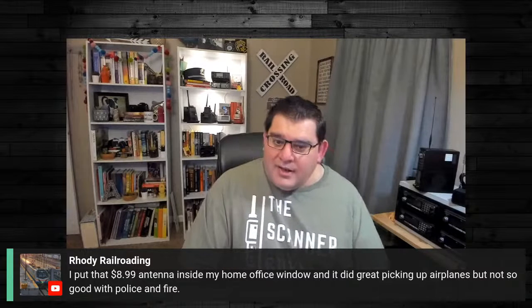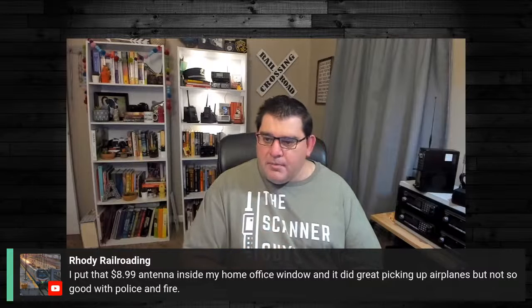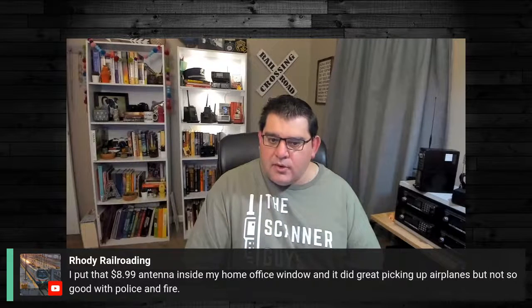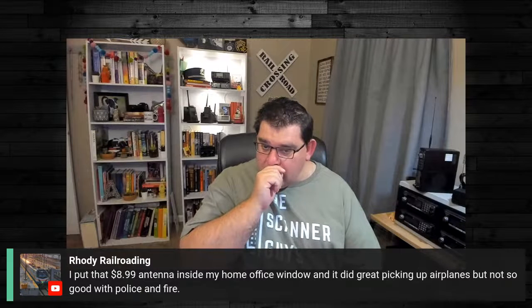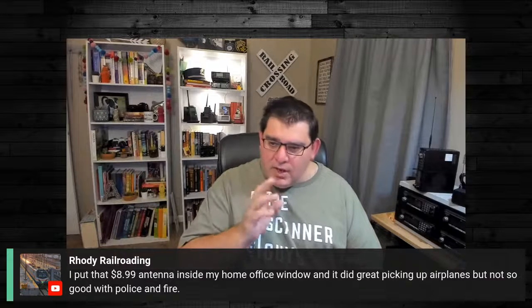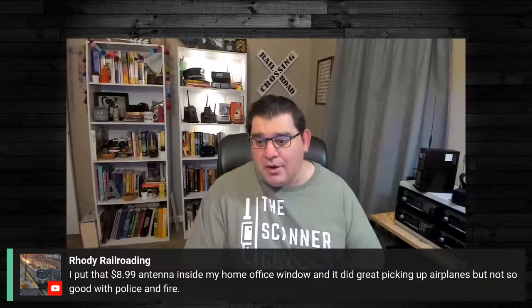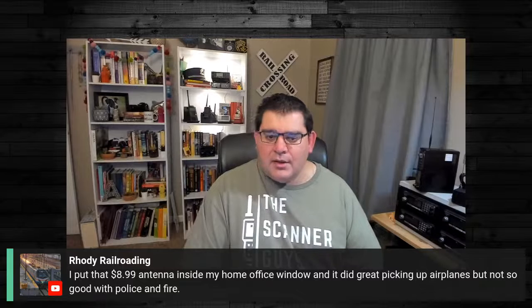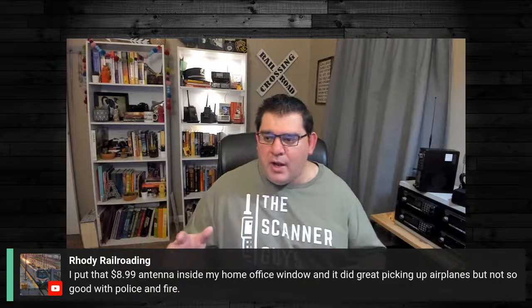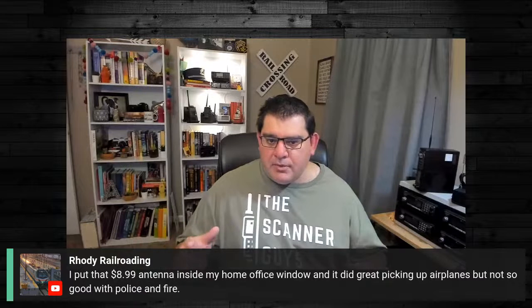The 899 antenna, you put it on the inside of his home on the window. It picked up the airplanes, but not so good on police and fire. Well, you're from Rhode Island, so that antenna is going to work somewhat okay on that 800 megahertz trunk system, but it's not going to be the greatest. So I would definitely recommend something like a really true wideband antenna to be able to do that.